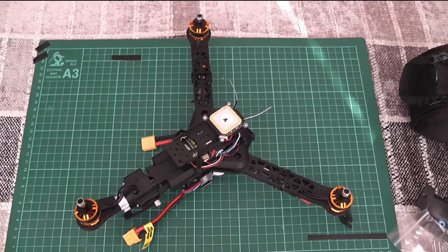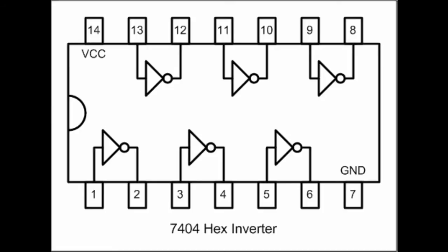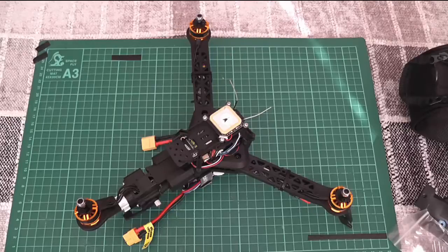When I wrote the settings back, the signals weren't inverted. I tried it several times under different operating systems — Windows 8 and XP — and that didn't work. So I rummaged in the attic, found a breadboard and a TTL 7404 chip, which is a hex TTL inverter. I wired that up to the FTDI board and to the receiver and was able to update the firmware.